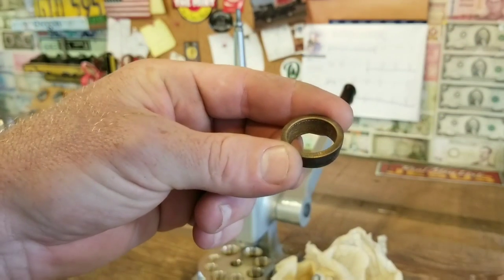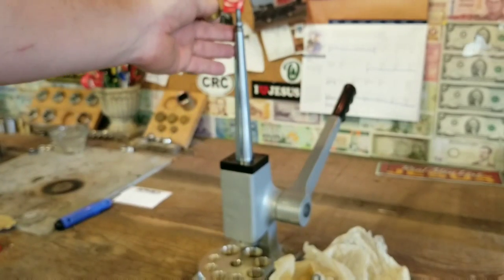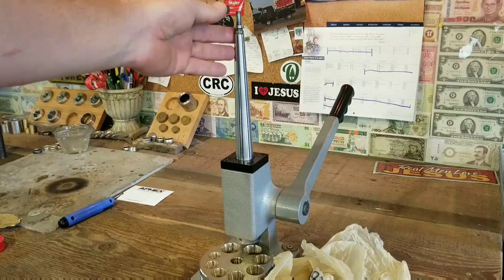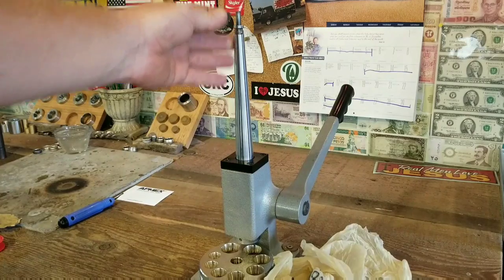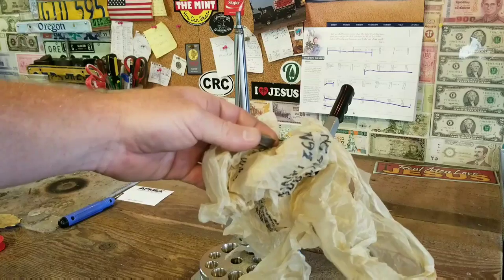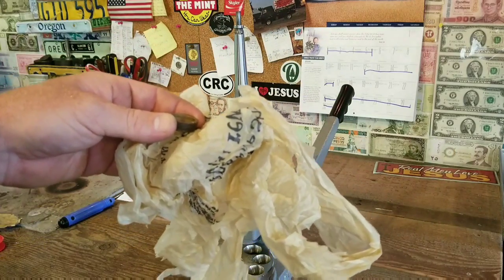Now we're gonna take our Gold Eagle coin ring, coin edge side up, and put it onto our ring stretcher. But remember that steel to gold contact we want to avoid, because we want all that detail on the inside still. So what we're gonna do is double up a grocery bag over the top of the splines to make darn sure nothing touches that gold. So we want it to be perfect when we're done.